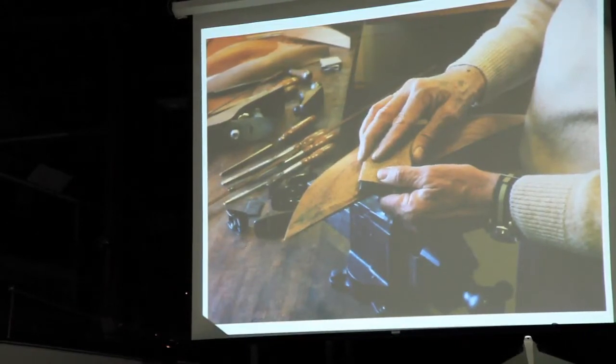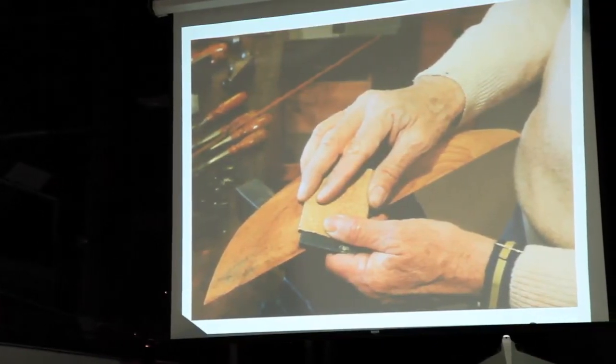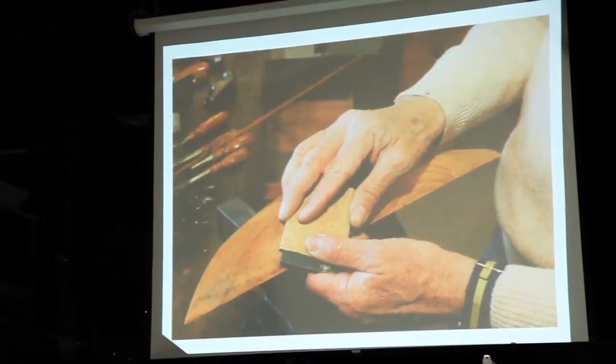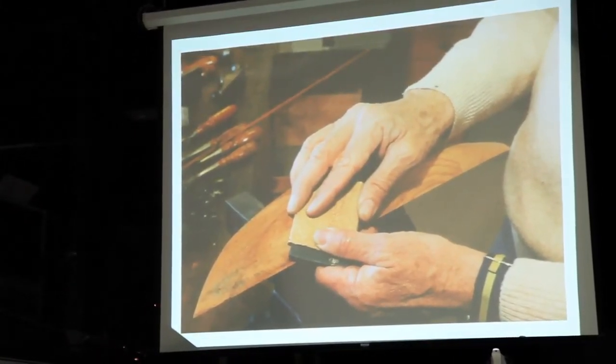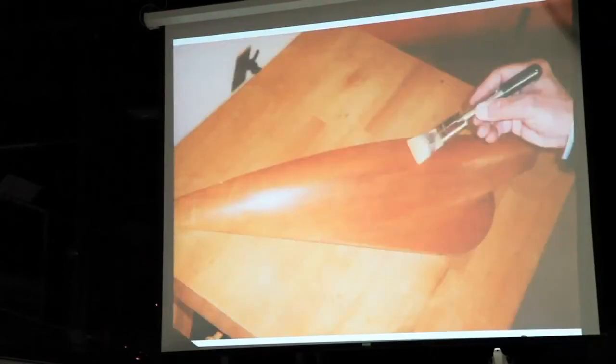After the complete shaping is done with the tools, the sandpaper is applied — a piece of fine sandpaper wrapped around a hard rubber block, which is rigid but able to be slightly bent. I'm guiding it with my small fingers along the rail in such a way that there's no possibility of inadvertently rounding that corner, so the edge is kept crisp as it would have to be on the full-size boat. Then after that, shellacking the hull.